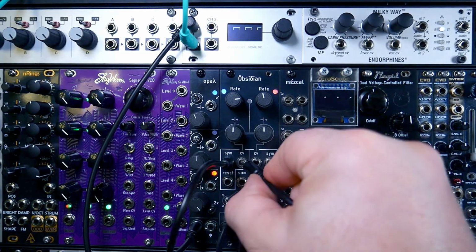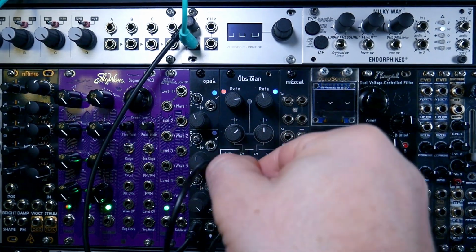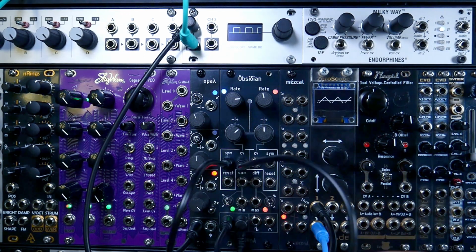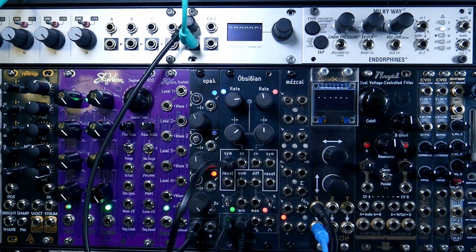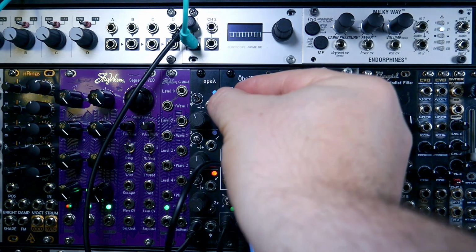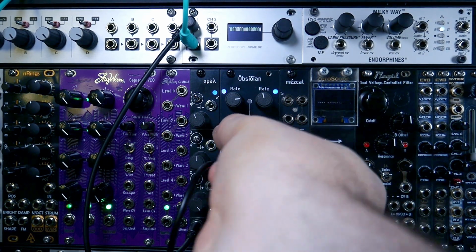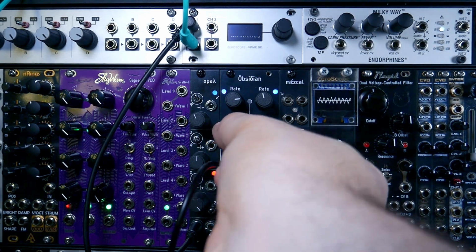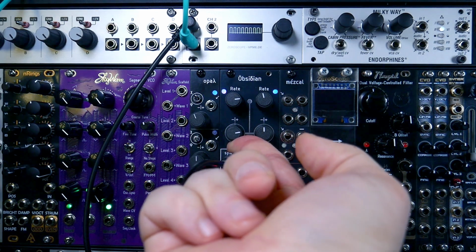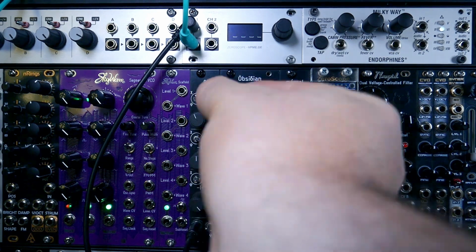Now if we plug into the CV input, it should stop that wobbling. And it did. And now we can take CV from anything and use it for pitch. And I'm not quite sure, and it probably doesn't track volt per octave, but you can get some semblance of pitch control with the CV input, and you have a nice attenuator. And you could get microtonal with a drone.